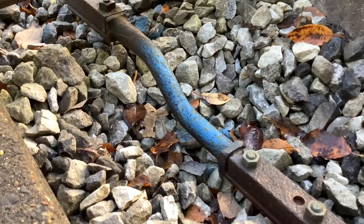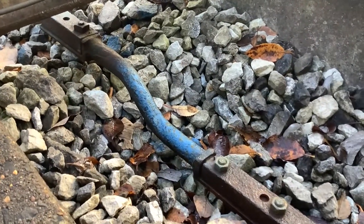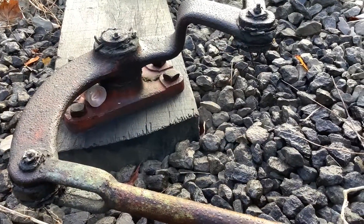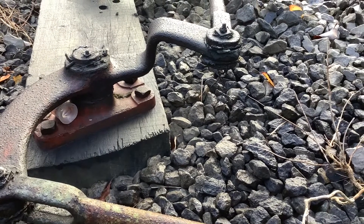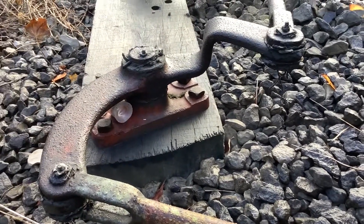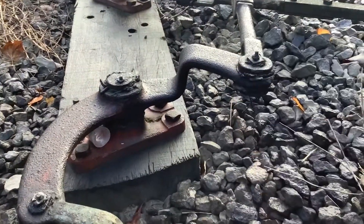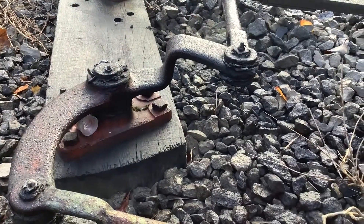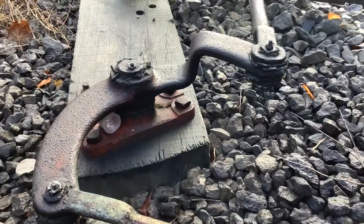Here we have one of our upsets in the rodding. You can go for a three-inch upset — this is just to get up to the level of the track because the track is higher here and the crank arm is down at the bottom. This is one of our already-made forged rods. Bearing in mind that most heritage railways acquire ex-redundant stock from British Rail and Rail Track, it's not unknown to have some odd-ball cranks. This one has obviously been outside a signal box at some point to get that really high lift, but we needed it to get around the problem — our track comes in low and our rodding run goes out high — and it solved that beautifully, so it's nice to reuse cranks where we can.